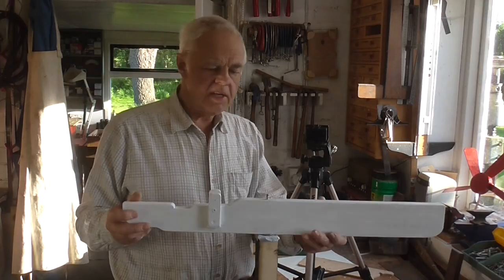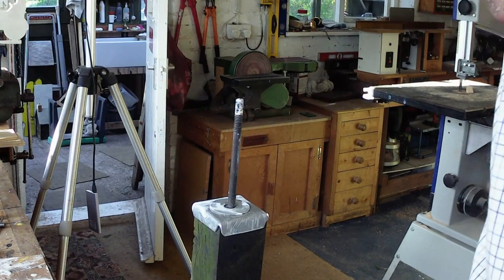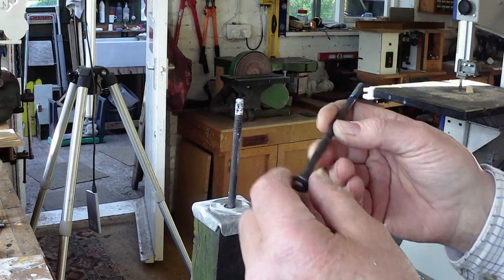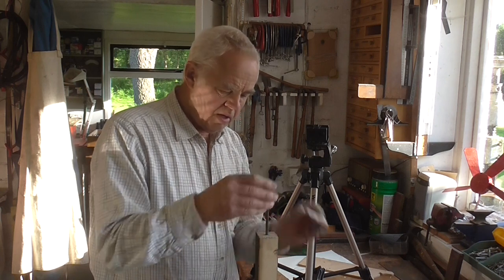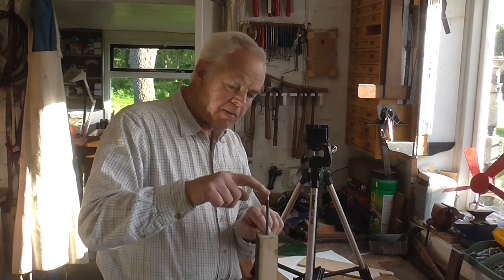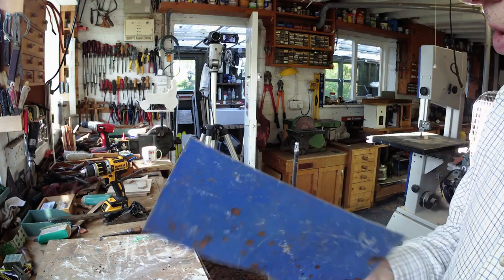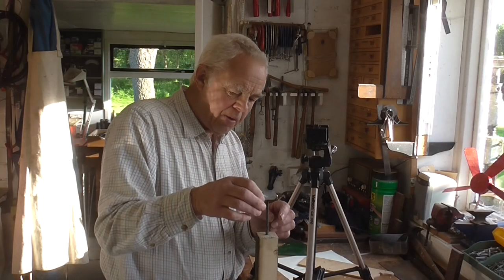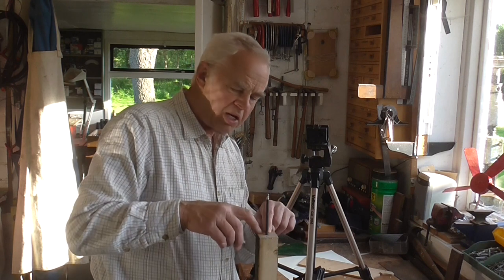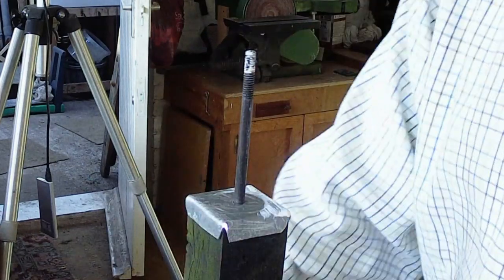When I've got it apart for painting, I'd like to show the method I used to fix it on the pole. I've taken a 5.5-inch by quarter-inch coach bolt, sawed the head off, ground it to a point, and hammered it into a drilled hole in the post to the right length — that's a really strong pivot. I've also cut a little square cap from a scrap piece of tin to put on top of the post, which is quite important because otherwise water will lie on top and rot the post away quickly.